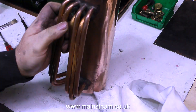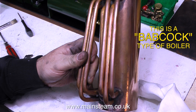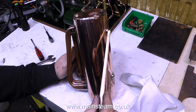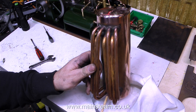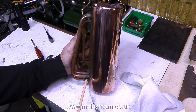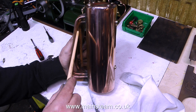So what about the construction of this boiler? It's very robustly silver-soldered together, very well made, and contains several tubes which hang under the main boiler barrel. As it currently says on the screen, this is a Babcock type of boiler. One really neat feature of the 500 series of boilers is the fact that the centre tube is not a water tube — it is a superheater. All the others are water tubes. The purpose of having these external water tubes on what is basically a pot type boiler is just to increase the surface area for heating.